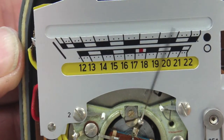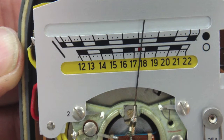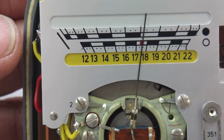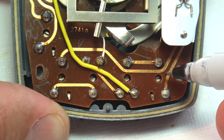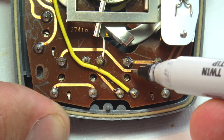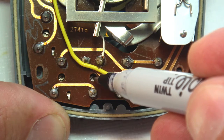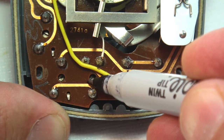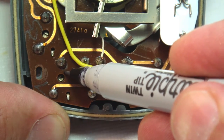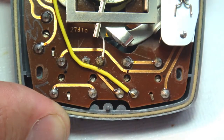If the voltage drop is correct, the battery check will be spot on. If you are so lucky, no further adjustments will probably be needed for an accurate meter. However, if adjustments are needed, mark the position of the high adjustments — the first two — the low adjustments — the second two — and the one off by itself is the battery or voltage adjustment.